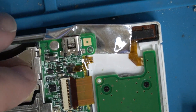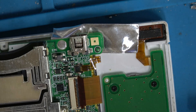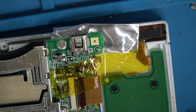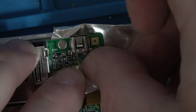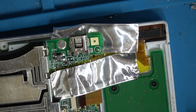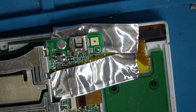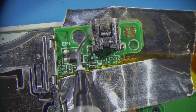I've also got a little ribbon cable there that I want to protect, because while I work in this area I don't want to accidentally nick a connector with the soldering iron. I'll put on Kapton tape, which is residue-free and easy peel, and then put the aluminum tape right there. Now I kind of have a work zone where I'm not going to melt any plastics. We're going to use low melt solder to remove it, going under the microscope with my fume extractor and soldering iron. Let's start by putting some flux where we're going to be adding the low melt solder.